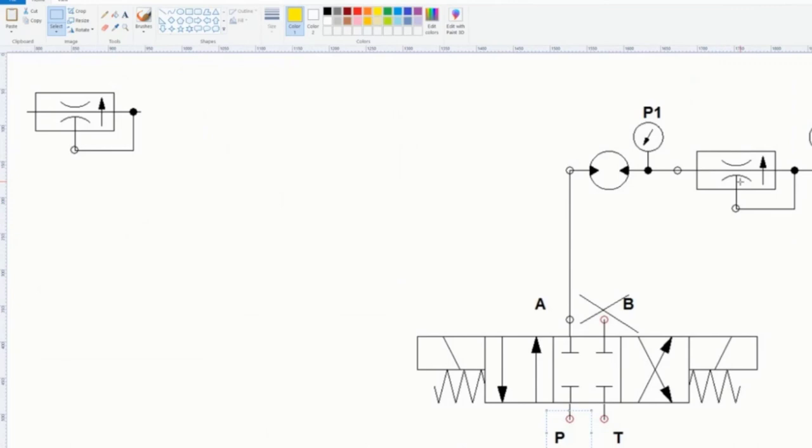But you may ask, well, why does the pressure change? Well, in hydraulic systems, what's going on is that the pump itself only has some power in it. And if I were to say, this motor has to run at the same speed all the time. And if I were to have some other process that was coming on and off, what's going to happen is that the pressure coming out of that pump or the pressure in the entire system may fluctuate a little bit, may change, may go up and may go down. And that's going to change the speed of the motor. You don't want that. So it manages fluctuation.